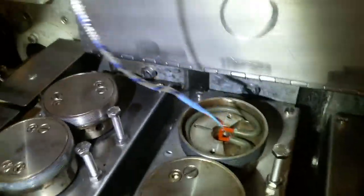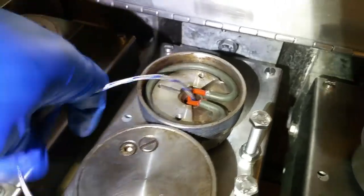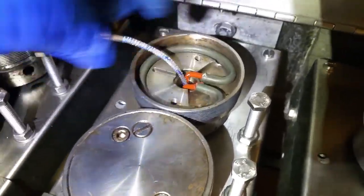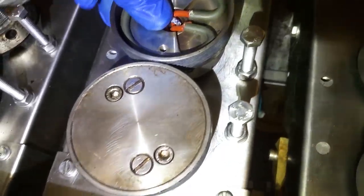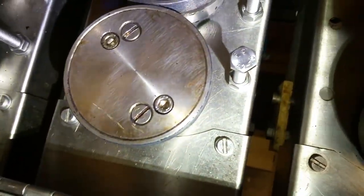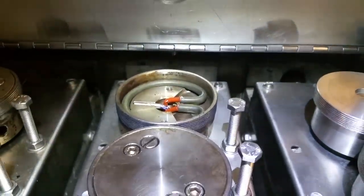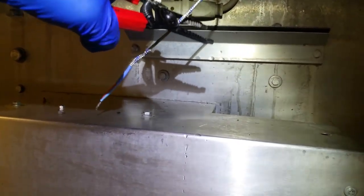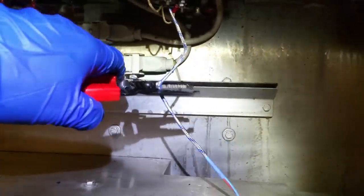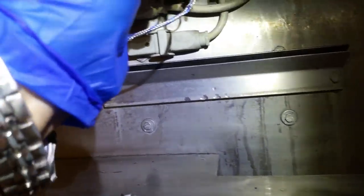The way we're going to do this is from the top down. Put in our wires and slide them all the way down in there. Lock our thermocouple in place — I might need to pry it down a little bit. I used the butt of the screwdriver to tap it in. Now let's go ahead and wire it down there. We don't need all this excess cable, so we're just going to chop some off — just give it enough to work with. Chop it here, strip these wires back, and put some connectors on it, and it should be ready to go.